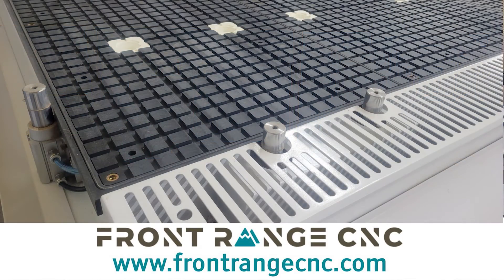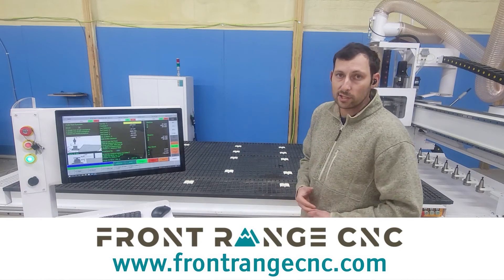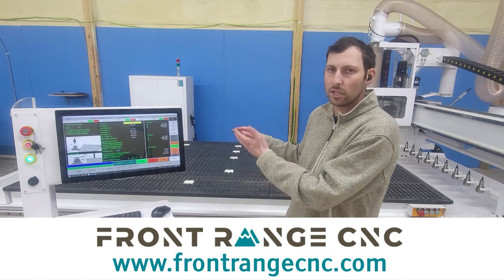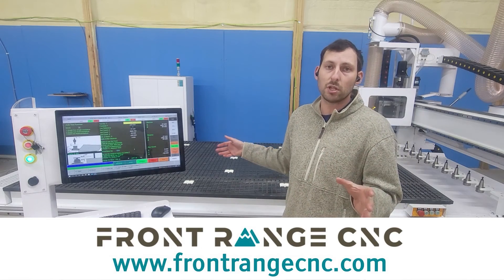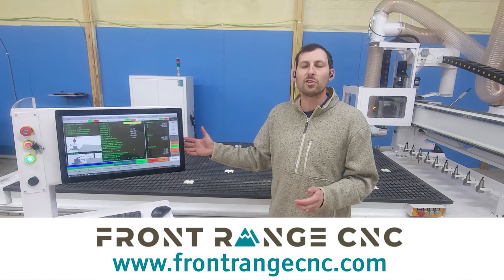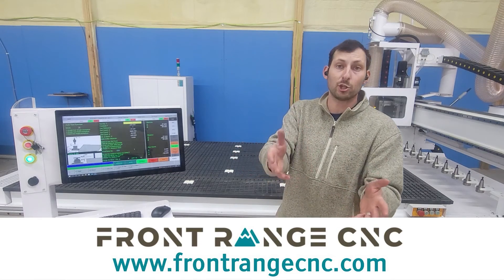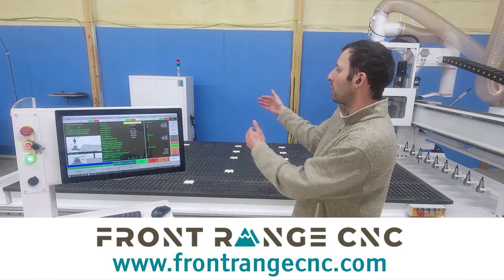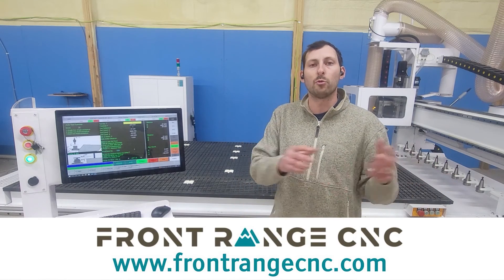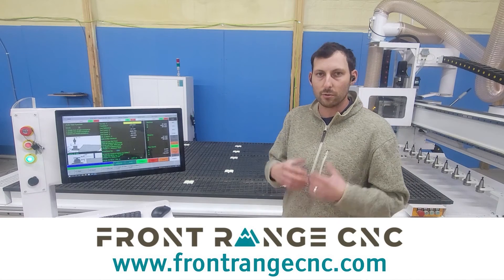Another important feature we wanted was pop-up pins. The pop-up pins are in the corner of the machine and allow you to place a piece of material against them — if you're making cabinets and going through 20 or 30 sheets a day, it saves time and effort. And when you pair the pop-up pins with our service of providing you with programs, it becomes very easy for us to design and orient fixtures so you can cut your fixture on-site using the program we send you, oriented based on the pins. This means we can make fixtures that are small and removable, so you're not using an entire sheet for one part.